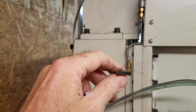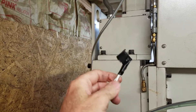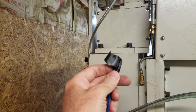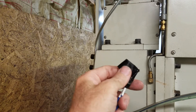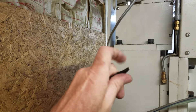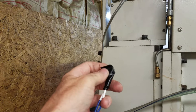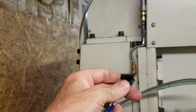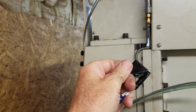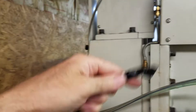I'm going to tape up the ends here so that the two wires stay together. A little tip on using electrical tape for wires — taping the ends like this — is to leave a little flag on it. Basically, you wrap the tape around it, and instead of just wrapping it all the way so you can't find the end and it's hard to take off, you just leave it long and bend it over on top of the tape itself. Then when you want to take it off, you just pull on this and undo it.